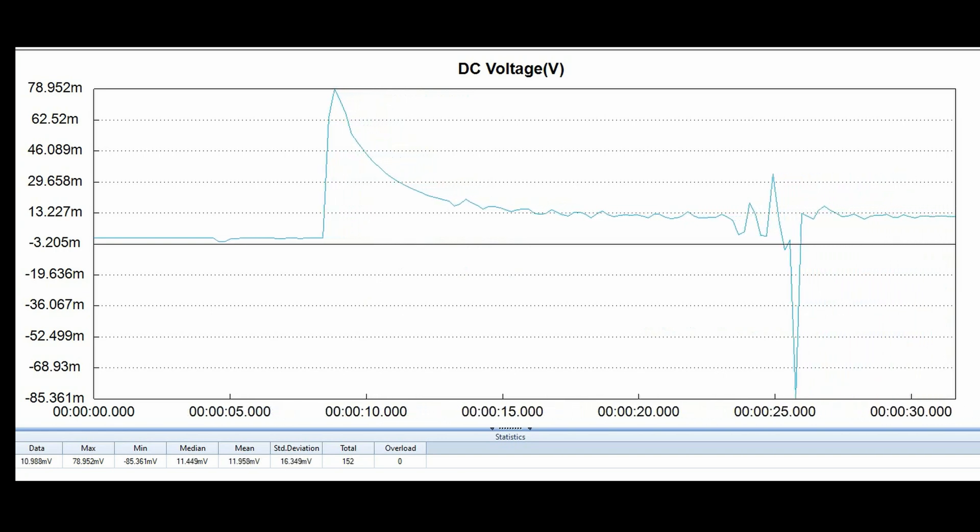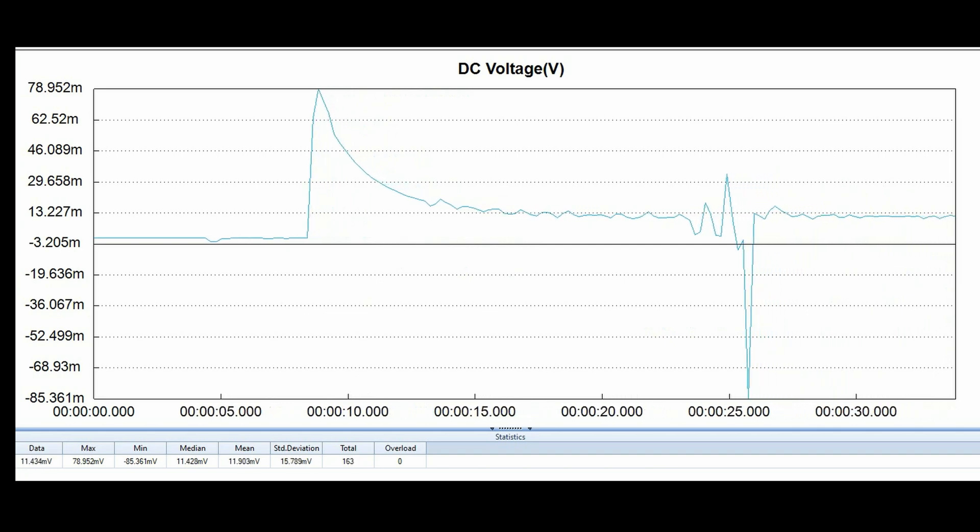Now look at that spike — a drop of about negative 85 millivolts. That is not normal, and this is the kind of problem I say that people don't even know they have. These are the types of things that may have started occurring five, ten, or twenty years ago, and eventually the equipment stops working. You might wonder why the protection circuit didn't kick in — the protection circuit in this unit doesn't activate until about 750 millivolts, about three-quarters of a volt. So as far as the amp is concerned, it's perfectly happy. Of course, your music isn't going to sound as clear and crisp as it can.